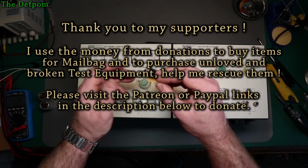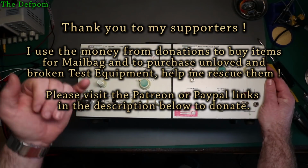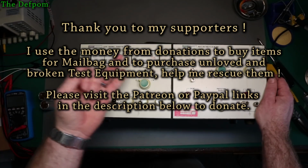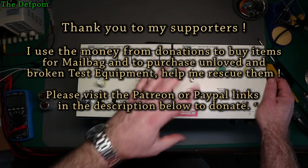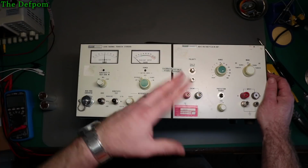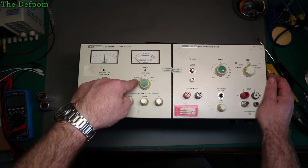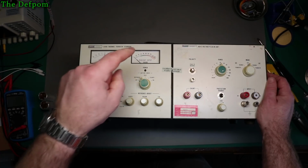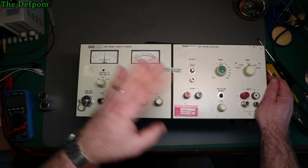The tricky thing is, this has got multiple ground circuits in it. It's got a chassis ground, and another ground which is used for the main battery packs and reference, like the main common rail I suppose. And the reference has also got its own ground as well, which only goes to the galvanometer and the thermocouple setup, so it's actually isolated normally.